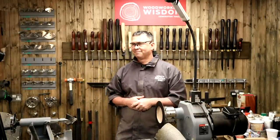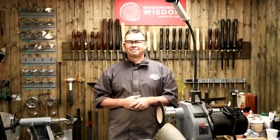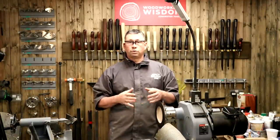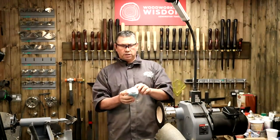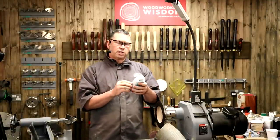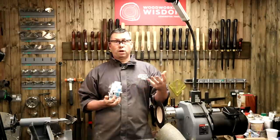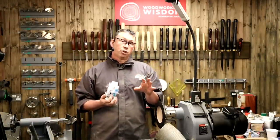Okay, so back to finishes. Question from Bryn. Any products that can stain various colors, dry very quickly, but is wipe on? It's stain. So this particular one is the chestnut one. Spirit stain, I would say more so. The thing with spirit stains, I've touched on it already. Spirit stains, they dry quickly. So really, you're turning within about 20 seconds. If you apply them through an airbrush, even sooner.